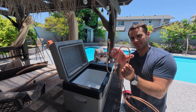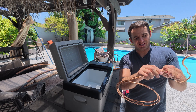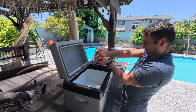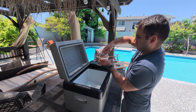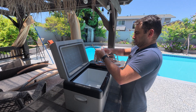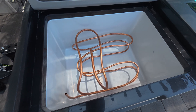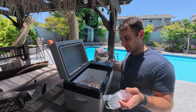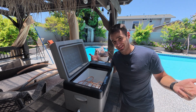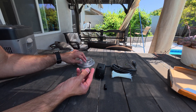I'm trying my best to keep the radius as tight as possible while not kinking the line. I figured I could just do it by hand — this doesn't have to be perfect, it just has to kind of work. So there we go, this is my heat sink coil, the best I could come up with. Let's make sure everything fits in here. Then connect the plastic tubing to the copper tubing, connect the pump up to it, fill with water, turn it on, and we're pretty much good to go.